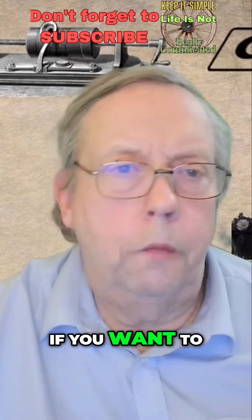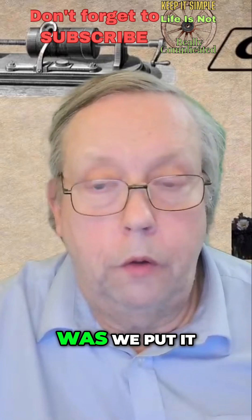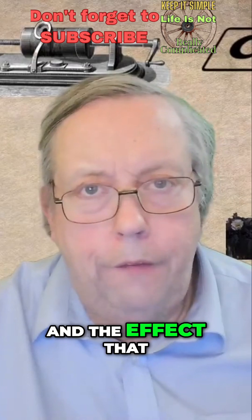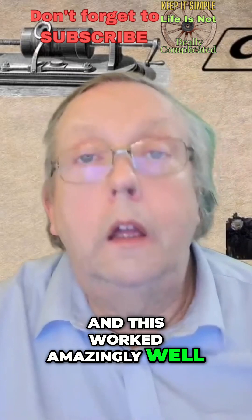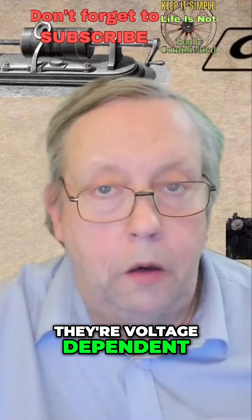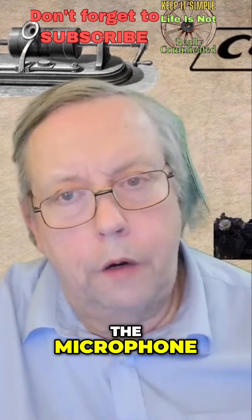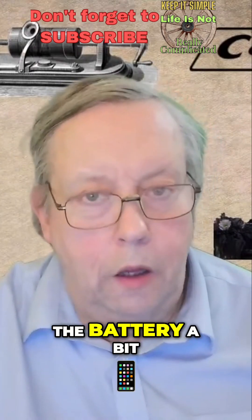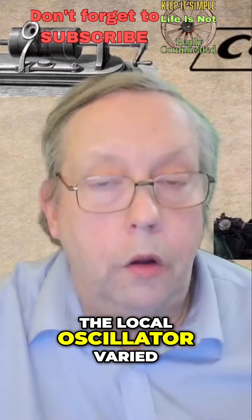What we did as kids — or students, electronic engineering students if you want to be posh — was we put that carbon microphone across the battery of a superheterodyne radio. It worked amazingly well because the radios are voltage-dependent and not that stable. As you spoke into the microphone, its resistance varied, which altered the battery voltage a bit, which meant the frequency and amplitude of the local oscillator varied.